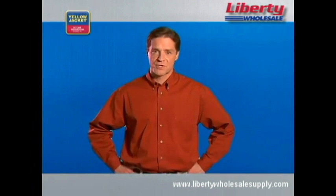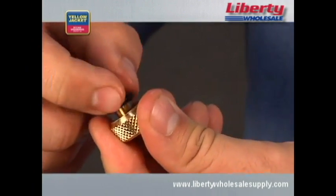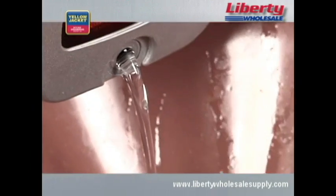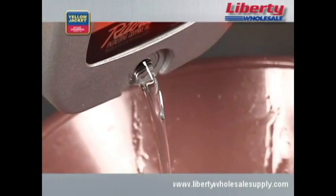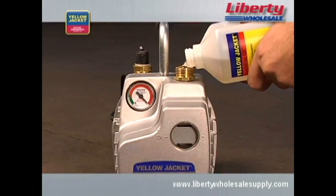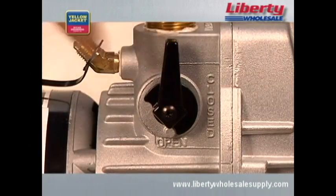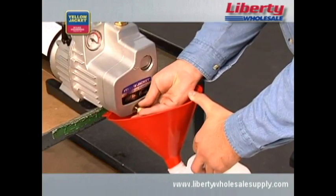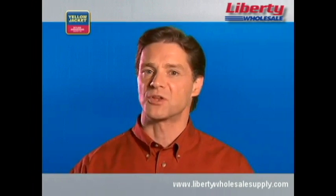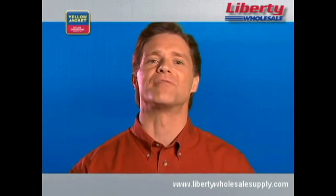Now let's go over a few quick tips on maintaining your vacuum pump. Before storing the pump, replace the fittings, ensuring the O-rings are in place. It's also best practice to inspect the oil. Most manufacturers suggest that you drain the oil after every use while the oil is still warm and replace with fresh oil, as contaminated oil simply will not pull down. To drain, first open the isolation valve to release the vacuum on the pump, drain the oil, and replace with fresh oil. Make sure to properly dispose of the used oil. Change the oil every time you use the pump — it will only work as well as the quality and quantity of the oil it contains.